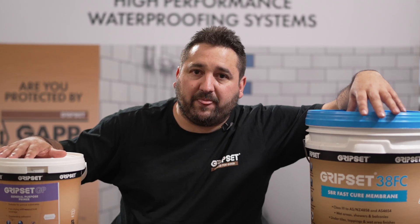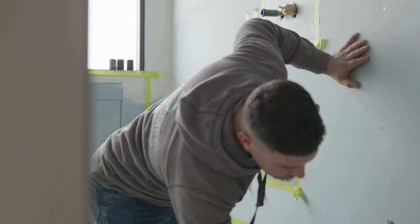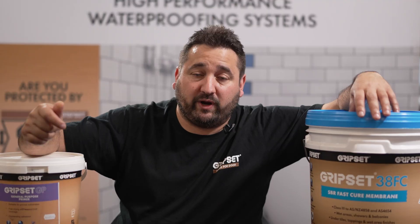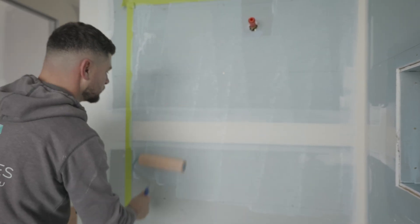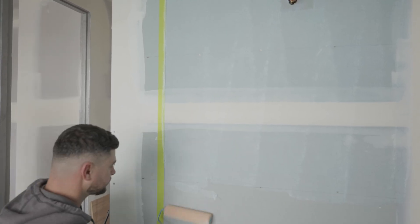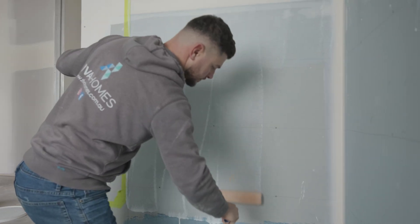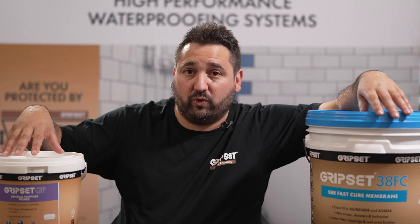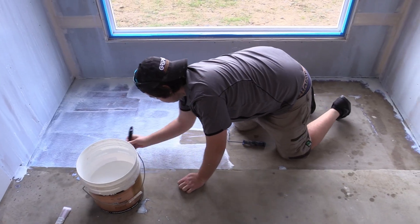This is where checking porosity and doing your water droplet test can be crucial. Those who are experienced and use the product regularly will be able to tell the minute you start rolling or brushing it onto the surface if the surface is really thirsty. As a rule of thumb when working out coverage rates, it's good to apply one or two square meters and watch what happens. If you see the primer getting drawn in instantly, or it's going from that white milky color to a transparent color straight away, assess the weather conditions — if you're working outside, is it particularly windy? It could be the ambient temperature causing that. Or look at the surface — do you see a little bit of bubbling? Is the substrate drawing in all the primer? If it's not staying in its wet state for between 30 to 60 seconds, that's a clear indication you'll need to do a second coat or prime a bit heavier.